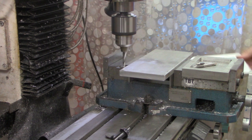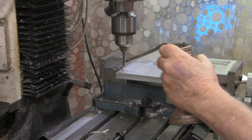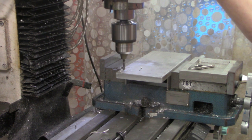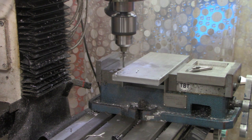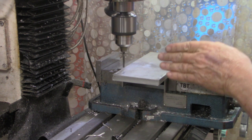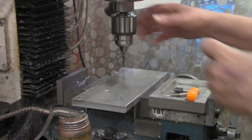Now let's move over three-quarters of an inch. A little WD-40 on that drill bit — that should hopefully keep this gummy aluminum from sticking to it. I'll keep moving down the row and bring you back when we're ready for the next step. Each hole I'm incrementing from the origin each time — not just stepping 750 thousandths from the previous hole — so if I'm a few thousandths off on one it will not accumulate. Each hole basically resets my starting point.